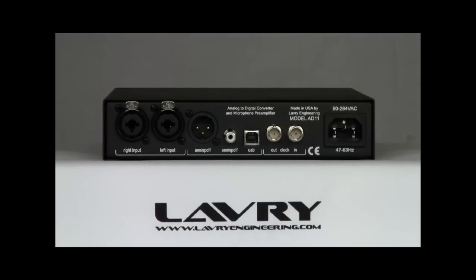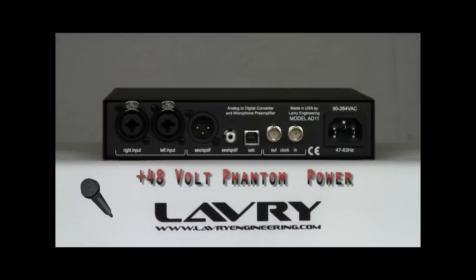The AD11 meets the same no-compromise specs for all combinations of gain settings and line input connections, which can eliminate the need for a more distorted or noisy method of raising the gain externally, such as using a desktop mixer. The XLR inputs can also be used to connect low-impedance balanced microphones, including condenser mics that require +48-volt phantom power.